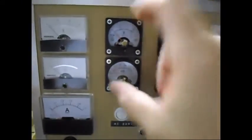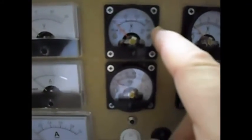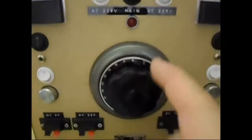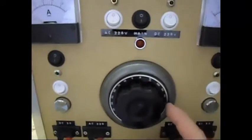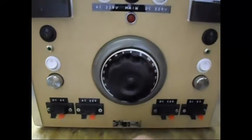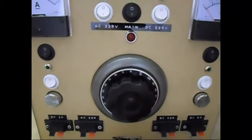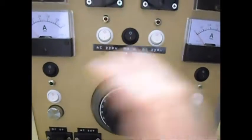This side is DC. As you can see I have here 200 volts DC. And I have here a Variac — so there is another Variac. This one is rated only 200 watts, which is for me way more than enough. I have never gone above 100 watts I think in all my testing, so for me it is more than enough.